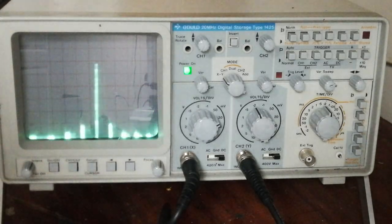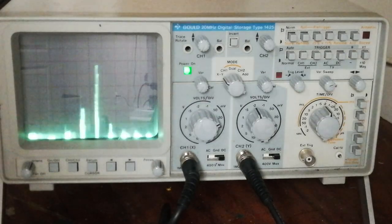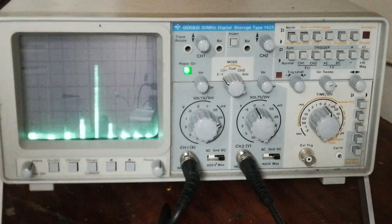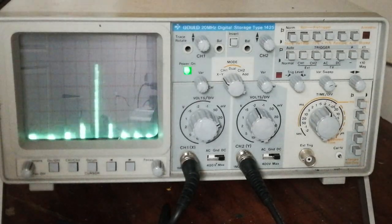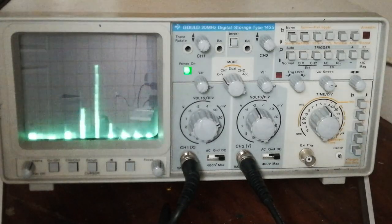So if you haven't been following my spectrum analyzer saga up till now, I suggest you check out my older videos on the topic. But just a brief summary, it is a switched capacitor system based loosely on bucket brigades, charge transfer devices, which time shares the main hardware of a biquad filter to make 10 bandpass filter outputs.